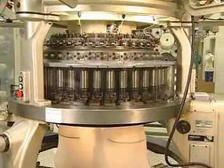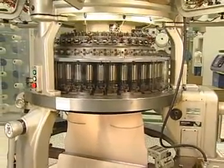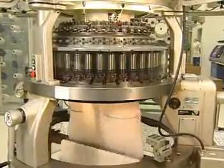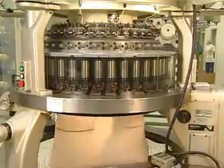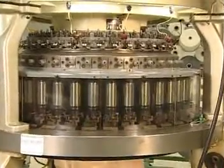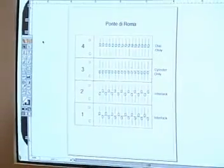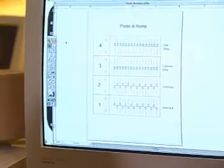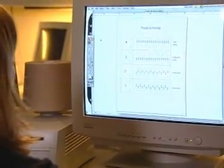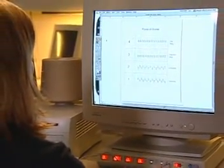Different double knit constructions can be made on rib and interlock gated machines. Needle selection by mechanical and/or electronic systems, along with yarn selection, determines the design effect. A variation of an interlock knit can be used to produce a structure that is tight and stable, where one course of fabric is attached and interlocked while the next is not.